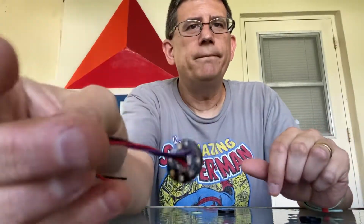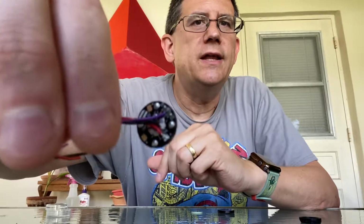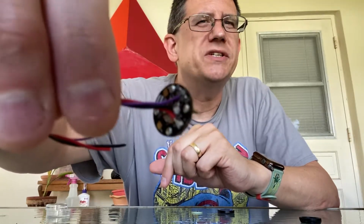And the other thing I did last night was I wired up our emitter. So I've got it all set up. I've got a positive 22 gauge wire going to the positive pad. I've got a negative 22 gauge wire going to the negative pad. And I have a purple data line going to the data pad. You can see that right in there. I'm using 26 gauge on this. It's the first time I've used 26 gauge. I usually use 28. But because I'm going a little bit thicker on everything, I decided to go 26 here.